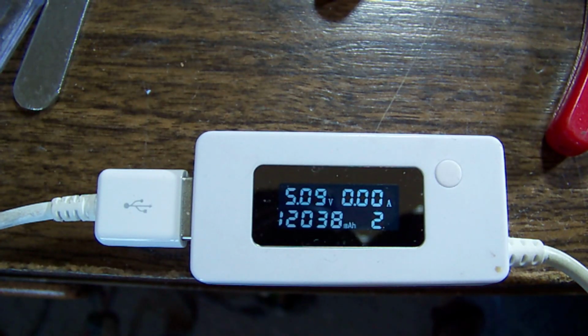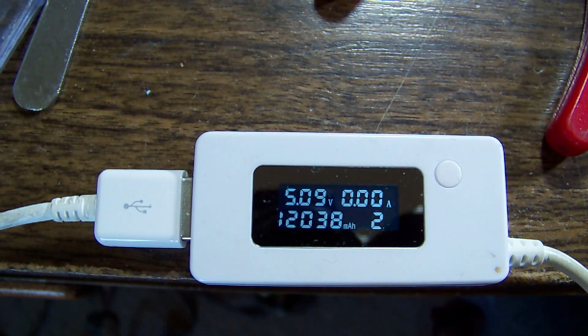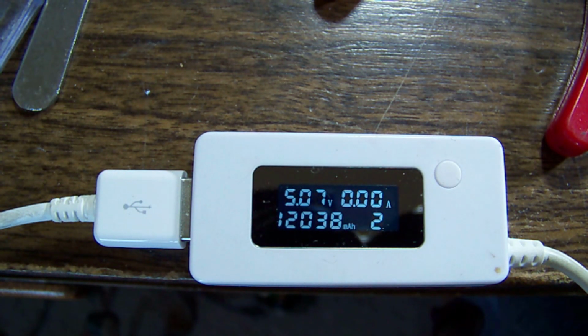And my USB ammeter handy, and the port is still lined up after screwing the battery in, so let's plug it in and see what happens. Nothing happens. This could be because the battery is likely a protected cell that's shut down. Let's check the battery voltage.